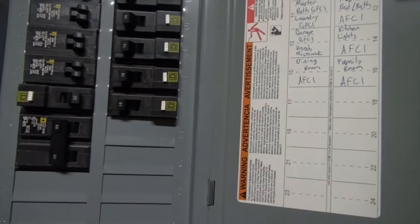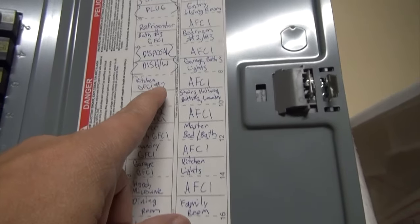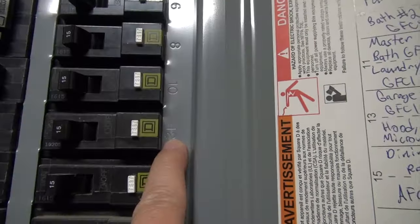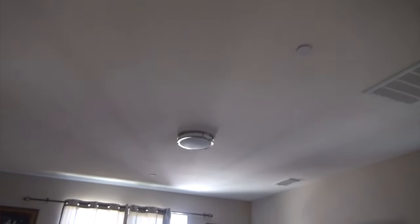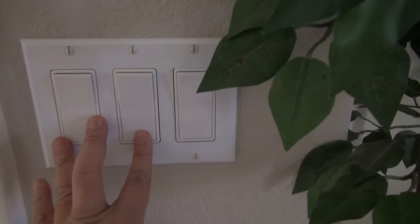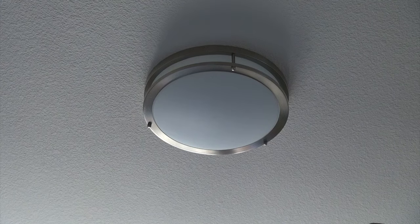This is my circuit breaker. Usually the breaker will come with labeling telling you approximately which room it controls. My master bedroom is circuit breaker number 12, so I'm going to find number 12 and turn it off. Back upstairs, the light is off — that means I turned off the right circuit breaker and I can safely work on the light fixture. I'm also going to turn every switch off in this room just to be safe. You're going to need a ladder for this.